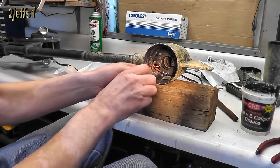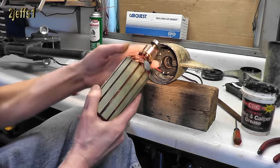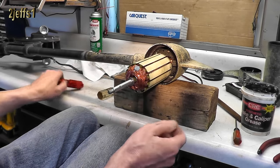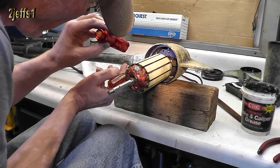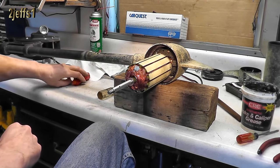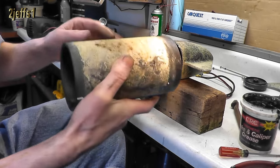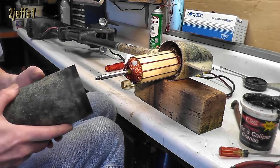I'll put a little dab of synthetic grease on the screws too, and a little coat of grease on the gasket. You want to check the bearings — checked them a while back, these are real good, no worries there. Let's set this in. The springs had to be released to put the load back on the brushes, so I'm going to trip those springs right now. Now you've got to get the case on. I put a little more grease on the edge of the case here too. Where they have the permanent magnets in here, they're a real strong force, so you've got to make sure the armature stays in contact with the brushes. This is going to create a heck of a tug installing it.